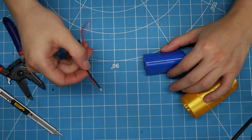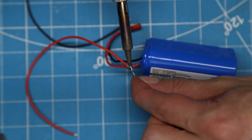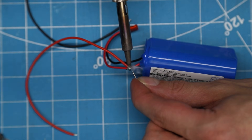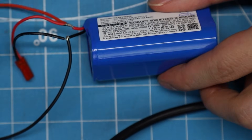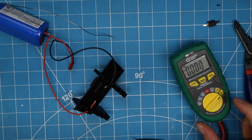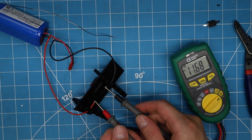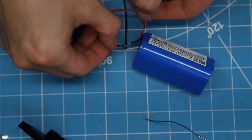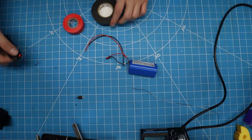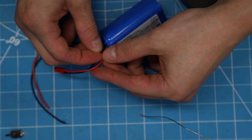Let's take those main cables from earlier and connect them to the splice points. To make sure we haven't messed up, let's check the voltage output — 11.68 is close to what we expect. More importantly, we should absolutely cover any exposed wire or connection with electrical tape before moving on.